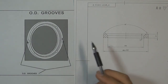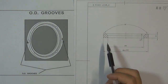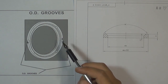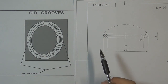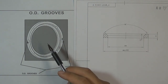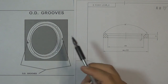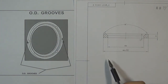That is the difference between the two kinds of soft seat ball valve seats. The big difference is that the new design has outside diameter grooves, so this kind of valve seat will have a long lifetime. If you want to check whether a soft seat ball valve has good quality, you can check whether the valve seat has outside diameter grooves, because this design is much better than the old design without grooves. Thank you for watching. See you in the next video. Bye-bye.